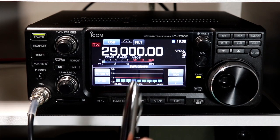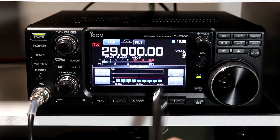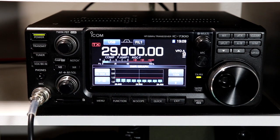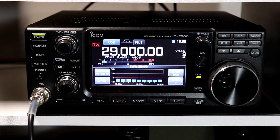You can see this particular antenna that I have is actually a little better toward the high end — you can see the graph going down here. So this is a great way to check out your antenna and see how it works. You can also see how broad it is with the tuner and how much tuning you may need to do in different areas by engaging the tuner and then repeating the same test.